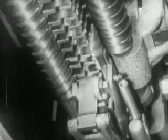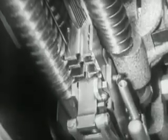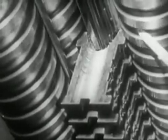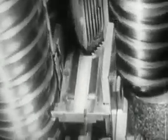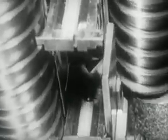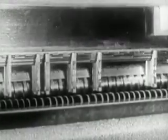Here the mats are raised, one by one, by the matrix lift. The slight lift is sufficient to insert the mats into the coils of the three helicoidal screws. It should be noted that it is not the function of these screws to keep the mats suspended, but only to push them ahead. The two upper screws engage the ears of the matrix, while the lower one engages the lower front lug. To keep the mats suspended up to the moment of their release into the magazine is the function of the distributor on which they glide, suspended by their combination teeth. Every mat is therefore supported on the distributor bar by means of their teeth, as we can see here.